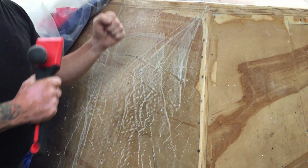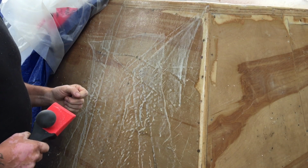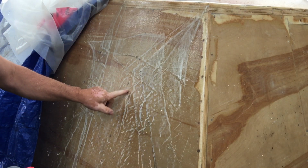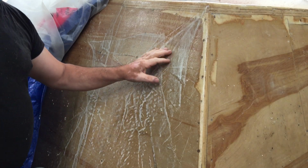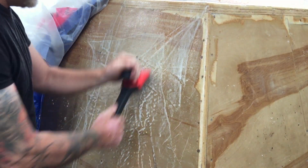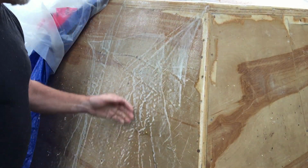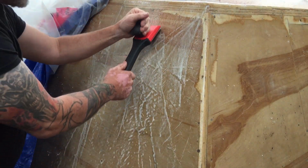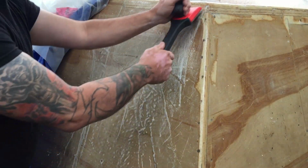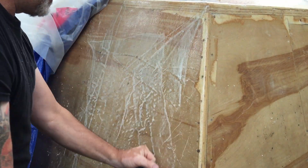Now I made that sander with the 50 grit sandpaper holder, and it cuts through this really nice too, but all these high spots here, you can save a lot of time by using a paint scraper and knocking them down. And as long as they're high, it'll just keep on cutting them down. See that?